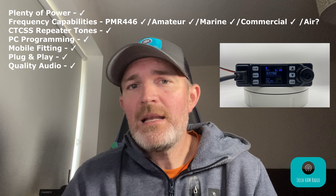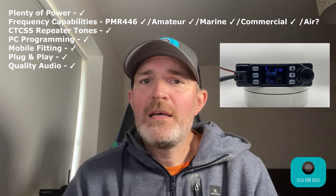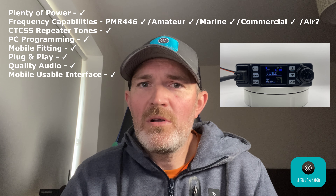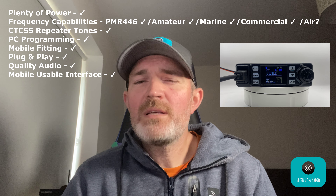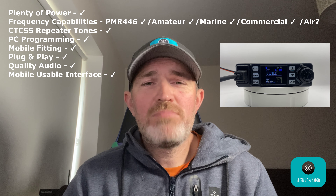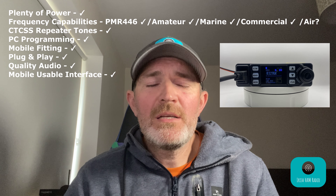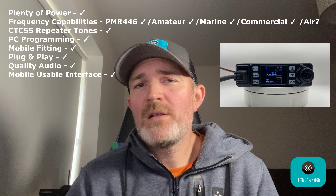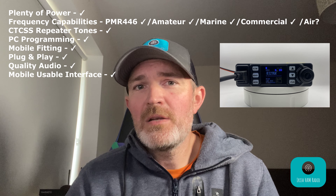In comparison to the slightly more expensive AT778 radio that I have in the camper van, the speaker quality on this is actually much better. The screen is quite small, although it really couldn't be any better used for the size that it is. Once I had this radio programmed the way I wanted, the buttons on the mic worked perfectly for me mobile. When I'm mobile all I'm really going to be doing is toggling VFO from my repeater to my simplex channel or opening the squelch — both of which I can do without even looking at the mic, just by feel of the buttons.